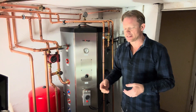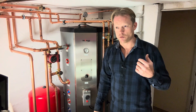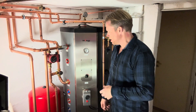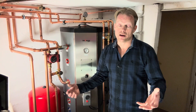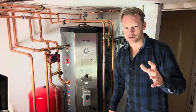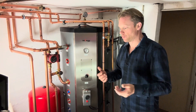The plan is to store all my solar power for myself instead of sending it out to the grid when my battery is charged. In the middle of summer I don't really need heat, but in early spring and late autumn there is still a lot of solar energy available. It's a good idea to heat the water in this tank with that extra power from the sun rather than exporting it to the grid — especially when energy prices are low or you'd have to pay to get rid of the energy.